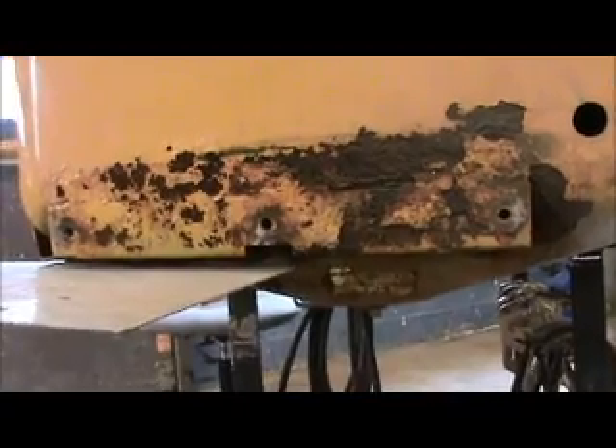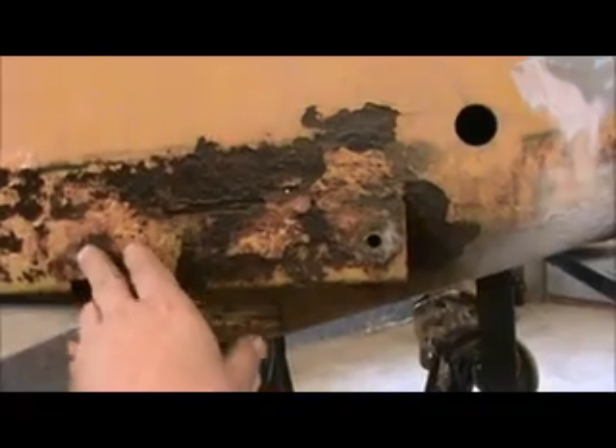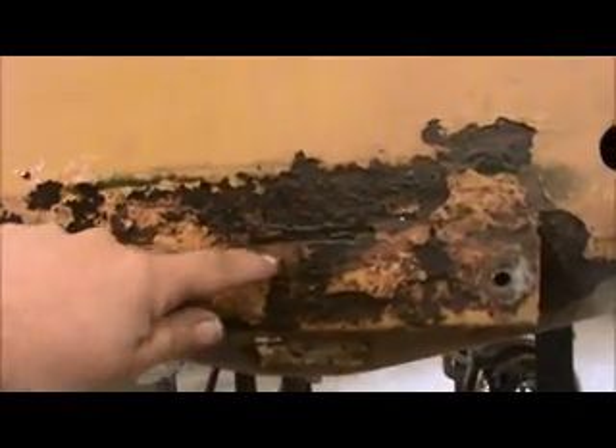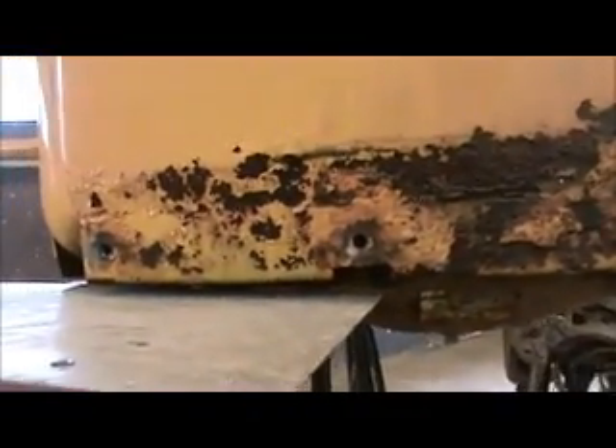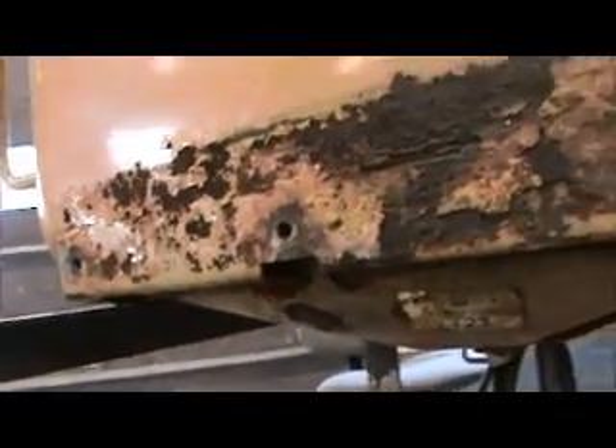Back at it. The next part of the fixture — we actually have to make a fixture to locate these holes in this bracket on the position of the tank. Now, we're going to shorten this tank an inch, but this bracket has to stay at the same height from the top even after it's shortened, so the outer sheet metal will connect to it. So I made a little template here out of some scrap. We're going to mount that on there and tack some blocks up here on top. When all my cutting is done on the bottom of the tank, I just slide this on, and that will locate exactly where the holes have to line up for that bracket. I'm actually going to make a new bracket too — I'm not going to use this old piece of junk.